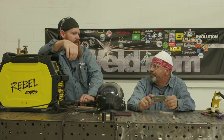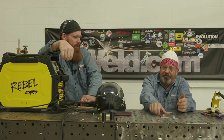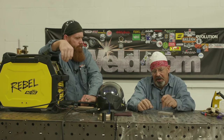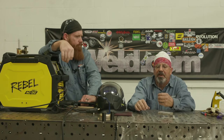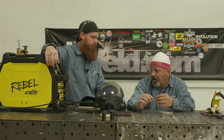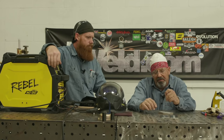So a couple of things: we're using small diameter tungsten, we're not destroying the tip, and we're changing things so that we can control bead depth of fusion. I can see real benefits getting into cope tubing, getting back in tight places, doing tanks — small thin stuff where we're buttering the weld versus driving it in for a fillet weld. I'm impressed with small diameter tungsten, weld profile control, and dialing in that impact zone — either a big frost zone with lots of cleaning, or driving deep in there and keeping it small and tight.